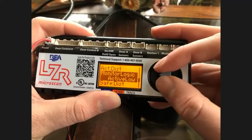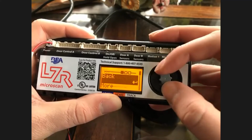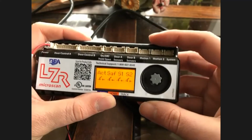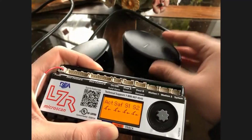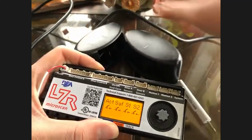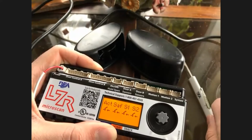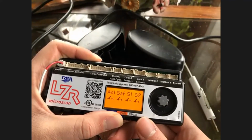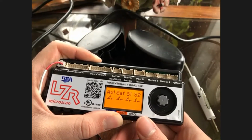If I install a new control and I retune the old door, do I have to perform a new sensor system learn? In most cases, no. I've had to replace controls that have had a problem. The door wouldn't work. In most cases, I've hooked up, and the information on these is designed for power outages. If you powered down the doors and you power back up, they would go through a self-diagnostic and kick back up and start functioning again.